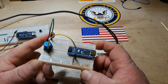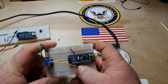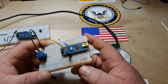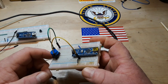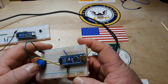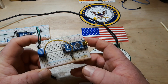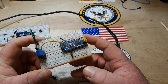A lot of the times that's all you need to do — that'll work — but it's not good practice, because digital pin two right there is now floating. What that means is it's not high and it's not low. This digital pin, when we do a digital read, is looking for five volts or zero volts — a one or zero, on or off, true or false. If you have some ghostly induced two volts sitting on that pin, we have absolutely no idea what the Arduino is going to do. So if you want to be sure, in this case we're going to use a pull-down resistor.